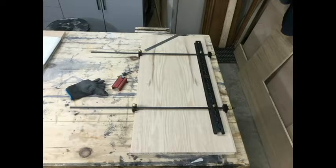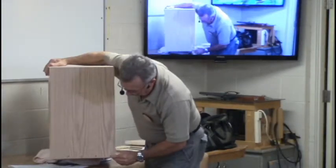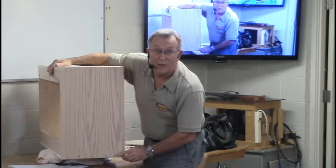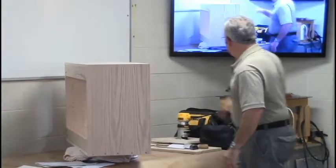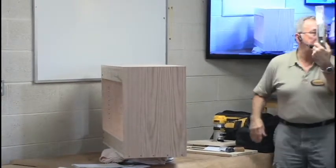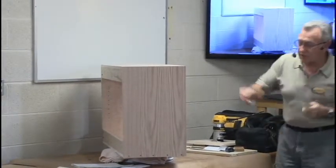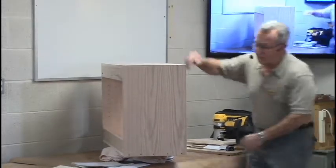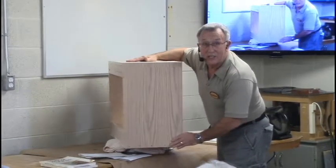This side here, because it's sandwiched against my cabinet over here, nobody's gonna see it, so it doesn't matter how I do this. And I've glued this. One of the ways I've done it before, I could cut a little plug, glue it, pop it in here, and you've all seen these saws, right? Flush cutting saws, smooth, they won't damage. And you just cut off the plug, and they'll do the trick. But because nobody's going to see this, I just sandwich against it.